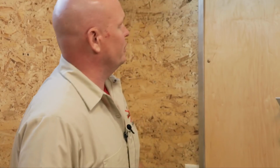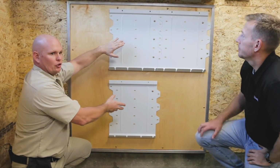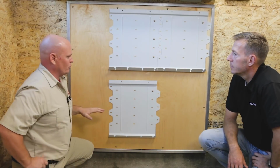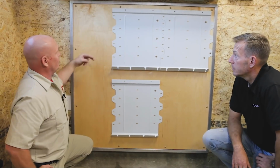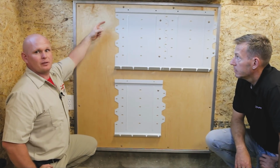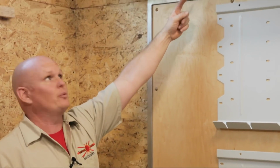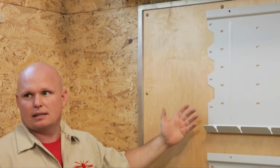One of the things to really put in the thought mix here is we were going back and forth whether we were going to put all the batteries face down for the cable runs or whether we wanted to alternate one. But with leaving room for this 4th battery that we're going to add later, it's going to be easy to bring down independent feeds for each parallel connection. And one of the other cool things is there's a spot up here that we can run a conduit down to also feed all of our comms cables, to keep that nice and tidy also.